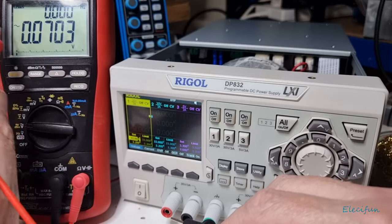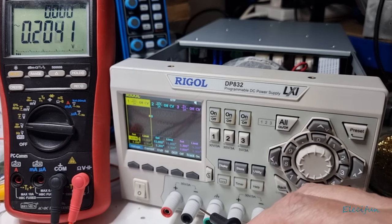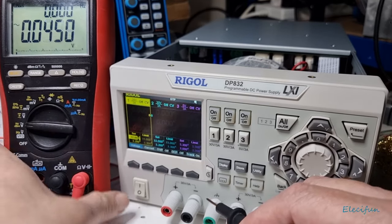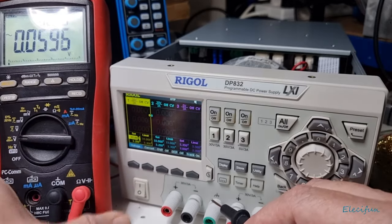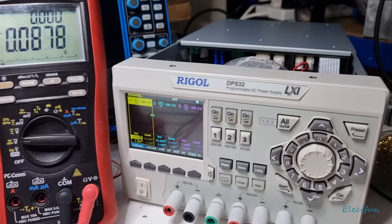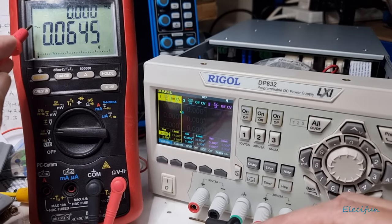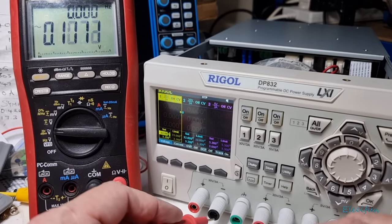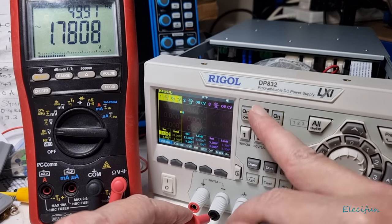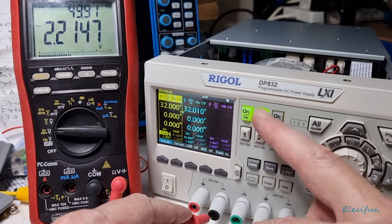But that's not what this clip is about. These caps on the front don't make any difference. I'm keeping this in the AC range and that's the frequency. Let me make that a little bit easier to see. We're in AC mode, so I'm just going to go from here to here, and we can see we've got 1.7 volts AC.